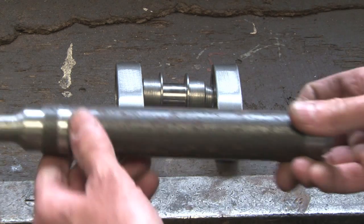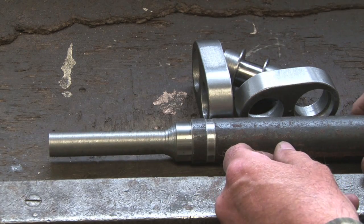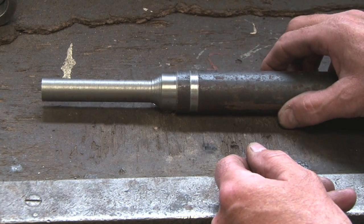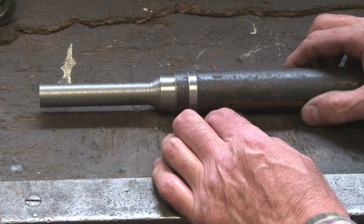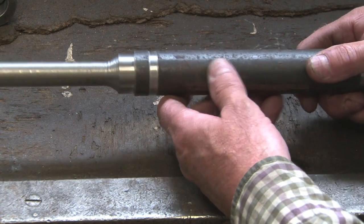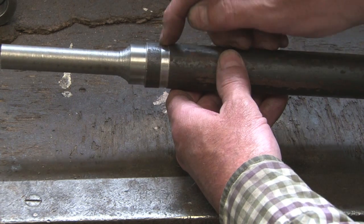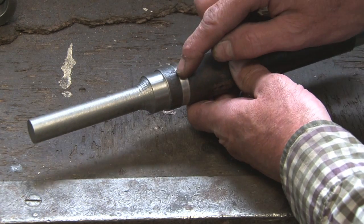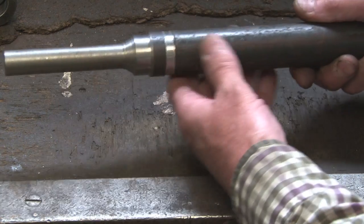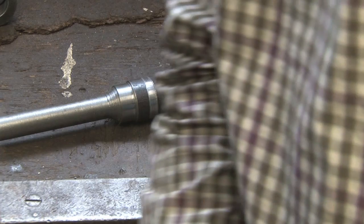We've got various components and bits of shafts which I've prepared for this job. We always have to plan ahead when we're making things like this and work out any possible problems that might occur. One of the things with the crankshaft is that when you get all these items shrunk and welded together, the heat generates potential distortion. So I want to have a clocking-up band on here — a little area where we can set the shaft up in the lathe and clock it for concentricity. Anyway, let's get the gas torch going now and get all these bits together.